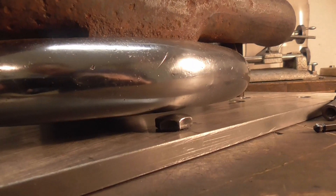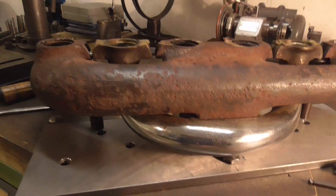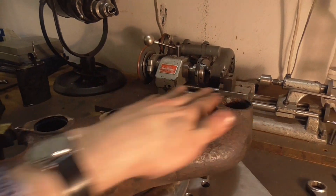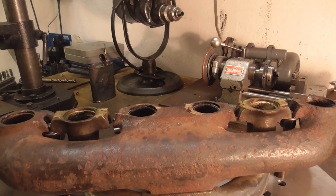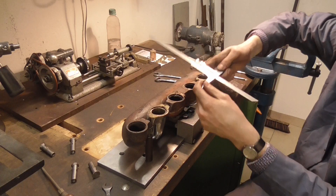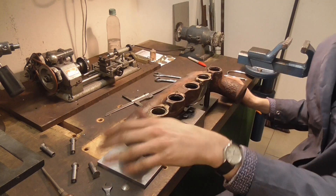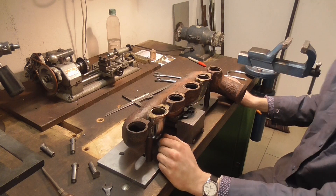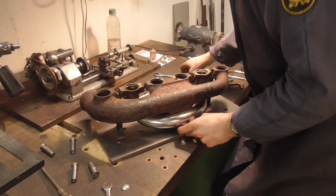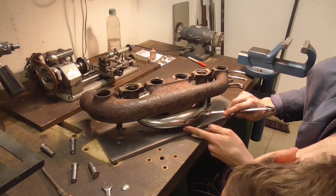You can see that the support screw isn't quite touching here, which is exactly what we want. Now we can go ahead and with these two nuts level out the surfaces to the base. This is only rudimentary with the depth gauge here — on the shaper I'll redo this with the dial indicator, of course. Now we can go ahead and raise this support screw until I can see the thing just about touching.